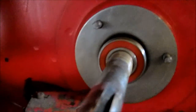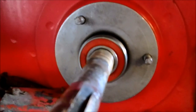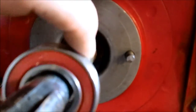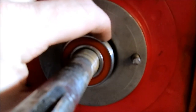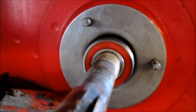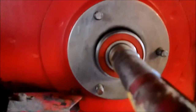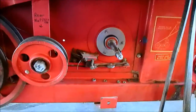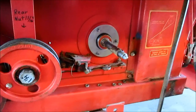So what I'm going to do is go back to the shop and get some Loctite. Loctite being an anaerobic, it sets up in a lack-of-oxygen environment. Once you put this on, there's just probably two or three thousandths there on that bearing. Once I put the Loctite on, it will set up and lock it onto the shaft. The reason why when you buy a bottle of Loctite it's only half full is because it would set up if the bottle was full.